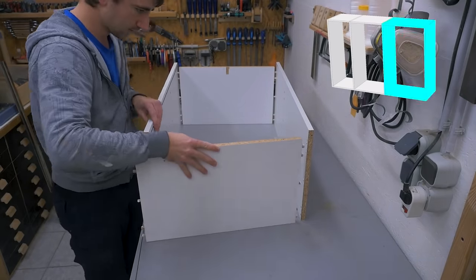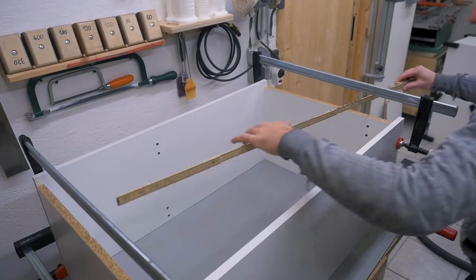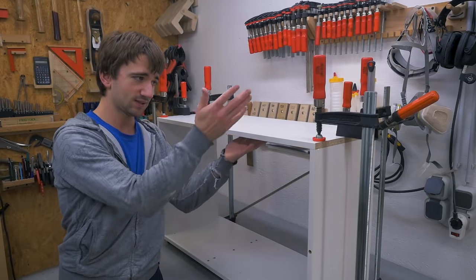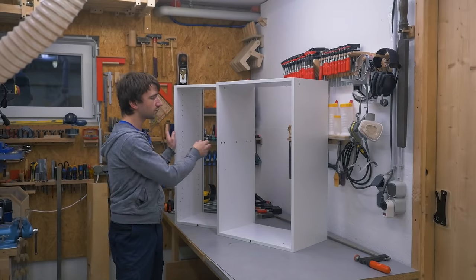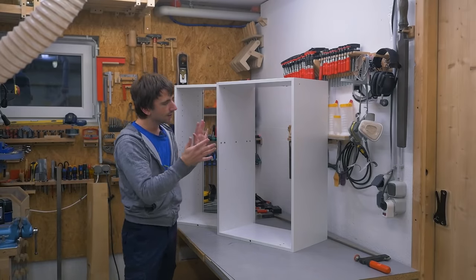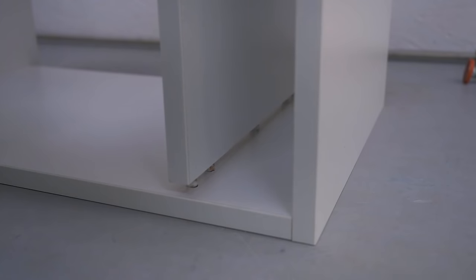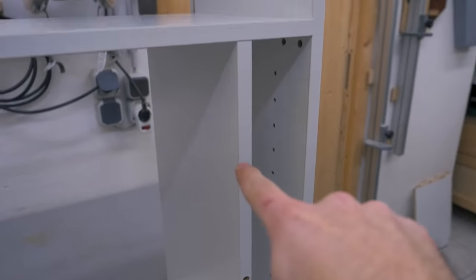Next was the bigger box on the right of the cabinet. 99.6 — we are not square. For dowel glue-ups like this you need big clamps and enough of them. The small box turned out flawless. The big one, not quite — about three millimeters off in the diagonals. It shouldn't matter, and maybe it already gets fixed when I glue in this next part.